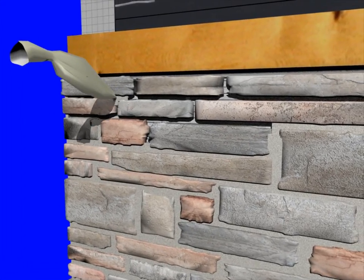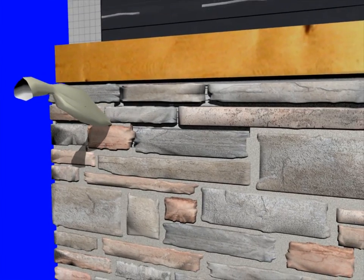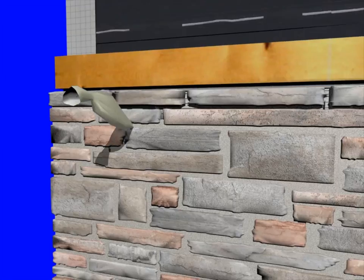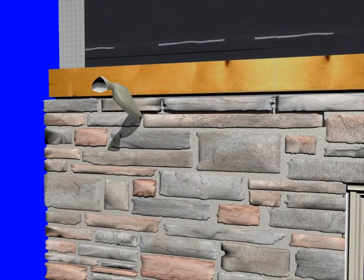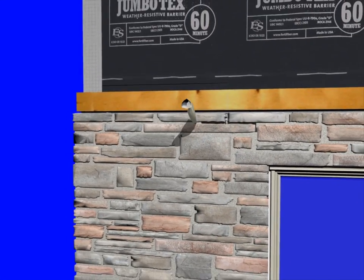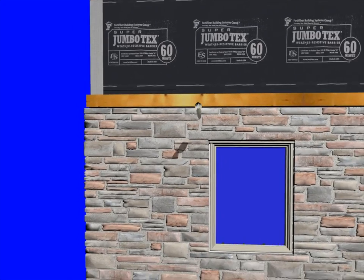The warmer the air, the more moisture vapor it can take with it. What happens is the warm air rises and comes out through that space, and cool dry air is introduced at the bottom. This actually creates ventilation behind the wall to help dry everything out and once again reduce the likelihood of problems with water penetration.